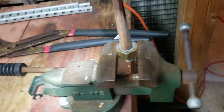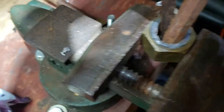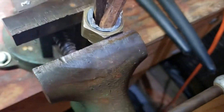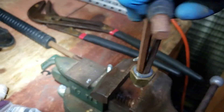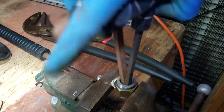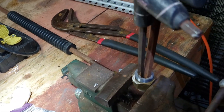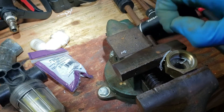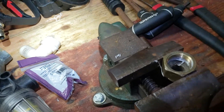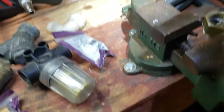You don't have to throw away this brass fitting just because that plastic piece broke off into it. Take a couple of allen keys — it's not really going to be any specific size. The other big key is to obviously set the bottom of it into a vise, because if you were trying to do that with a wrench it might not work.